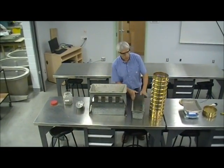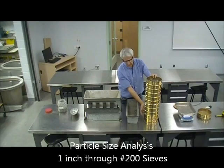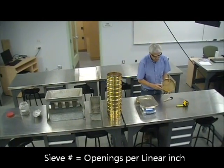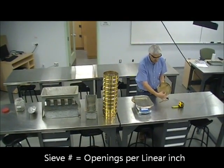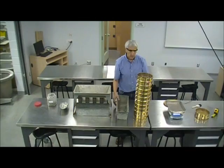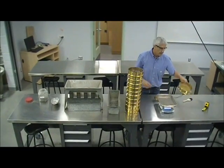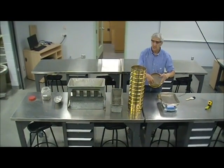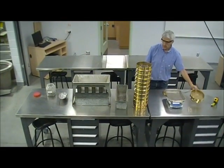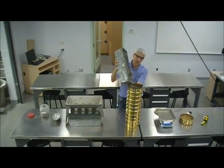In our testing, we assemble a series of sieves ranging from the one-inch to the number 200 sieve. In the description of the sieves, when we talk about numbering, the number 200 would mean that there are 200 openings in a linear inch. We have the stack of sieves ready to go, and the procedure now is to carefully inspect each one for damage — there could be a tear or material stuck from previous use — to make sure you start with proper sieves before passing the material through.